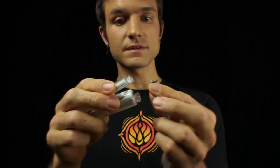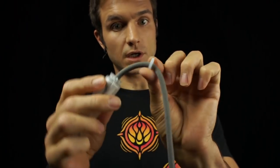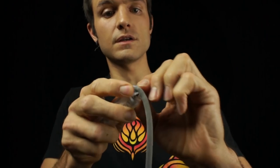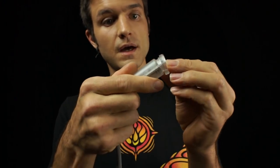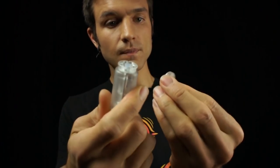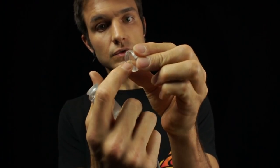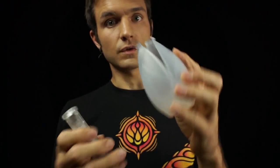To assemble this, put the washer inside and snap it shut. The O-ring needs to be on your leash so you can then stretch it over the end of the capsule. The C-ring snaps onto the bottom. There are two little shoulders on the capsule, and those shoulders fit into the two shoulder grooves in the C-ring. You have to have that aligned right, and you should be able to just push it on like that.